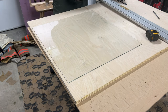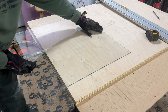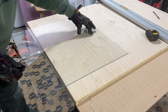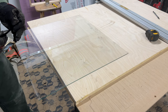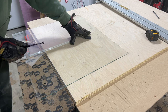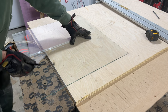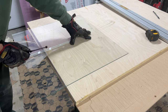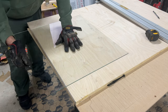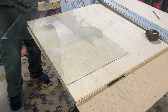Slide your glass out so that cut is right on the edge of your plywood and keep it in place. Then use the ball end of your glass cutter to give a bunch of taps right close to where you scored — you can actually hear a difference in the sound and see that crack run through the glass. Keep firm pressure on the pane and then give a quick downward snap and you get a nice clean straight cut.